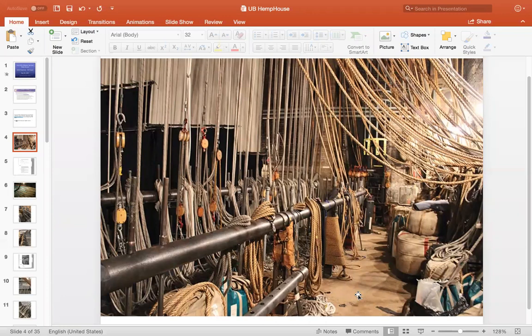Generally, if you're not going to be moving a piece in and out, you don't necessarily have to put a sandbag on to counterweight it. You raise and lower it with the block and fall and a Sunday that's wrapped around the line set. And that looks like what they've done here. Those are probably lighting pipes or something that, once they're trimmed, they don't move. So they're tied off to the block and fall, and they didn't bother to put a sandbag. The sandbags are those things on the right made out of canvas, and they can weigh anywhere from 20 pounds to 400 pounds. And that's how you counterweight your scenery, by hanging a sandbag on the line set.